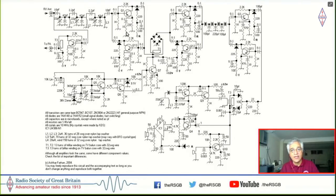Now, if you see here, these two transistors make this feedback amplifier, and the same block is actually replicated 3 times over. So I didn't have to learn to do anything new. I just had to make the same block without making mistakes. And I could refer to the voltages of the previous block to see what the correct voltages should be when I was making this. So I reused exactly the same circuit here, which is the good thing about BITX: if you can build one single transistor amplifier, then if you just take time to build another 6 of them, with a total of 7 amplifiers, you are in business.